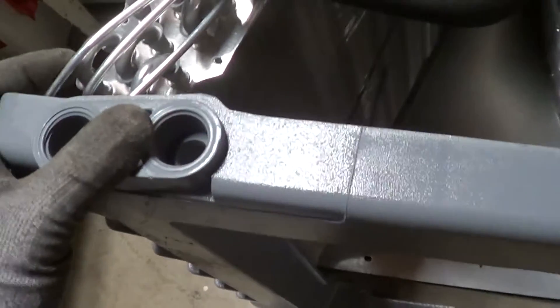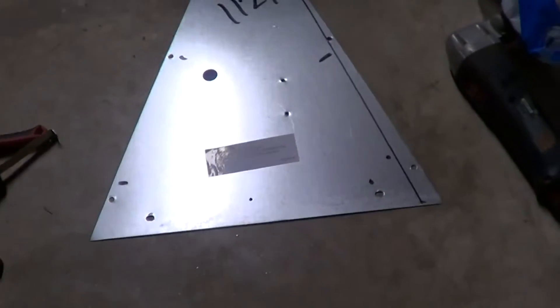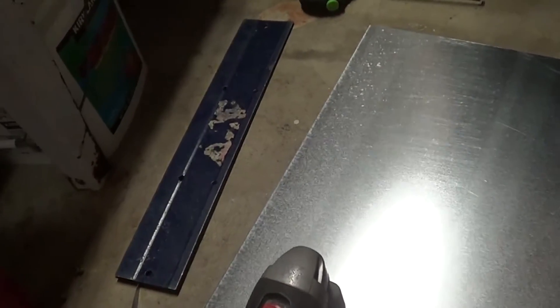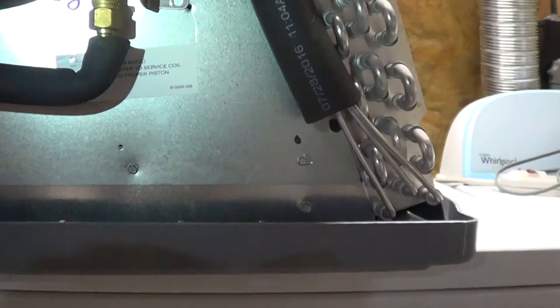Now since I'm raising the coil up an inch, I need to close it in three quarters of an inch so that it's not too wide at the bottom. That's why I'm going to cut this back with my nifty cutters. Don't have your steel touch your aluminum anywhere. I'm going to make a channel which is two and a quarter wide — that's the coil — and then two one-inch lips. I'll cut that out and fold it. The aluminum coil is going to stay high and dry.